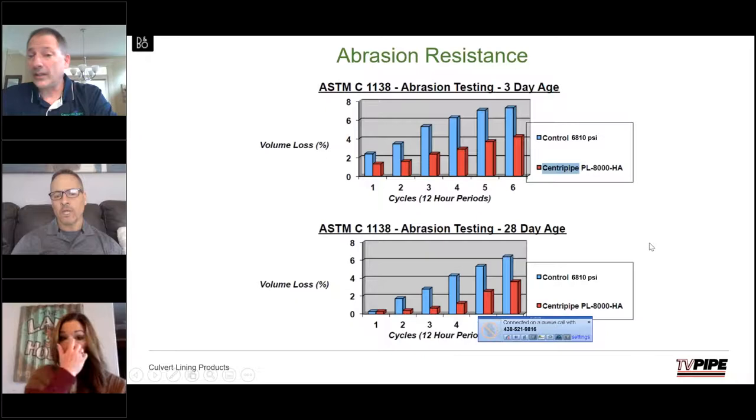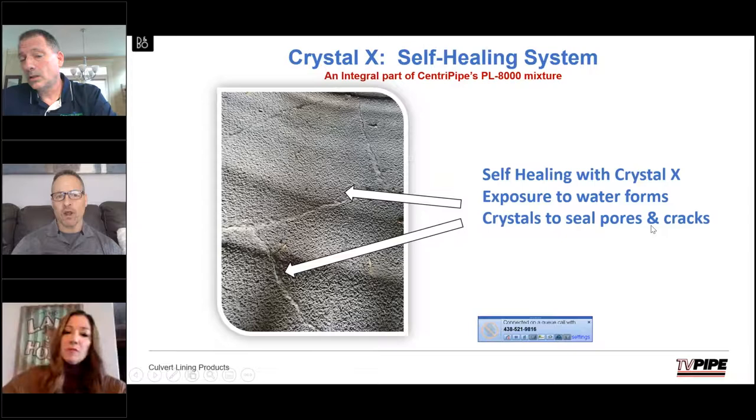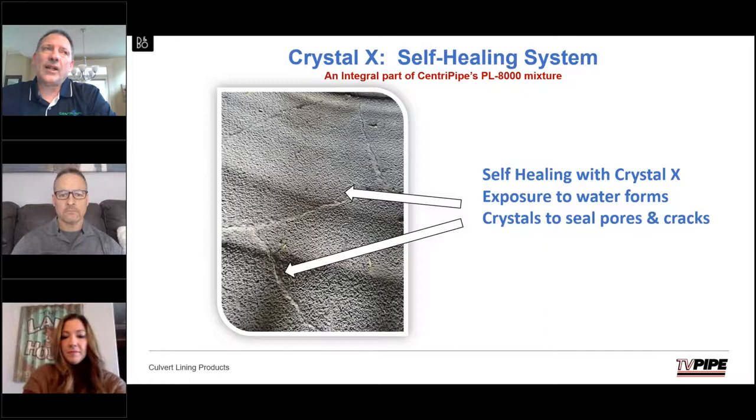Can you elaborate on the time required for self-healing? The self-healing will continue because it's a waterproofing agent. We had a customer situation where the liner was put in late in the fall, and there was weeping going on. We came back, made the assessment, showed them the results, and they were satisfied. It's going to be over a couple of months, and when it comes in contact with water it'll heal itself. Our material never cracks beyond 0.625mm. Even at the crown of the pipe that doesn't get water, it's still not going to crack to the point of becoming a faulty liner. Most of these pipes carry a large amount of water and they're being healed up and sealed off.